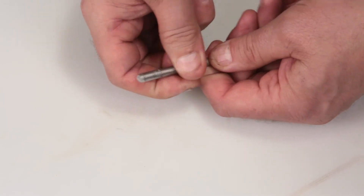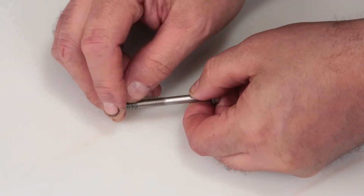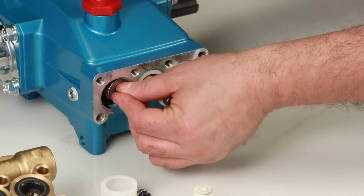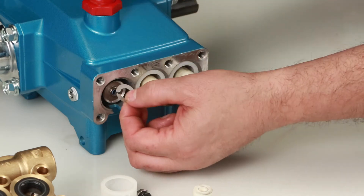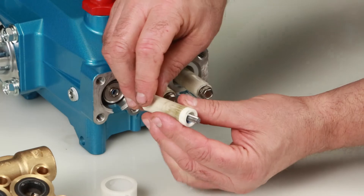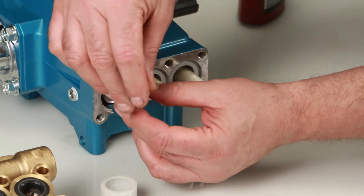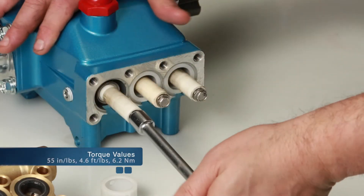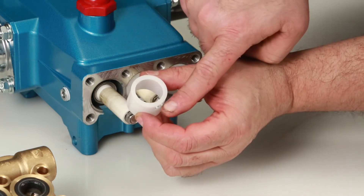To reassemble, replace the gasket on the end of the plunger retainer. Next, install the barrier slinger with the dish side facing away from the crankcase. Then install the keyhole washer — the slot can face in any direction. Insert the plunger retainer into the plunger. Before installing the plunger assembly, apply thread sealant on the end of the plunger rod. Tighten using a 10mm wrench and torque to specification. Install the seal retainer with the tab facing down into the notch of the crankcase.